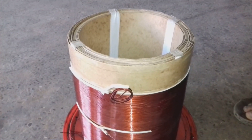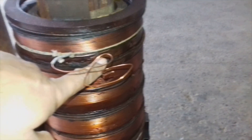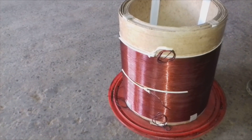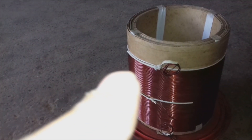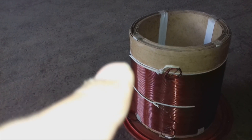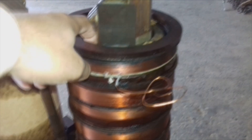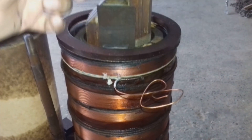If the winding is on a single limb, you need very good paper insulation; otherwise with thin insulation it will be damaged. When winding on a single limb you must insulate very properly and use very good paper. But with disk-type winding you can use thinner paper for insulating the coils.